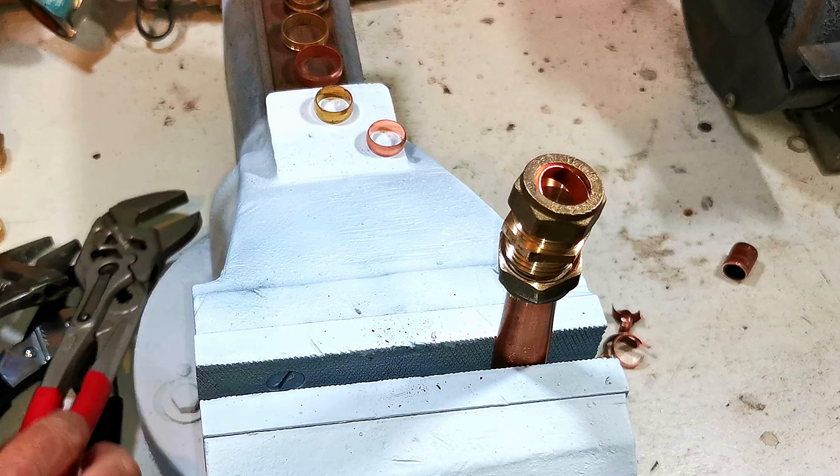Just to sum up: the Monument olive cutting tool is a really great little tool. I carry them in my toolbox all the time. What's good about them is you can get them into those tiny spaces where you can't get another tool - get in there, cut that olive off, remove the nut, and replace it. The only downside is they can leave a little scratch on the pipe, and they aren't cheap at £27 and only cut 15mm olives - so if you want to cut 22mm you'd also need the other cutter. But that just about rounds it up. Click on my next video, subscribe, click the bell, give me a thumbs up, and don't forget my toolbox fund. Bye for now!